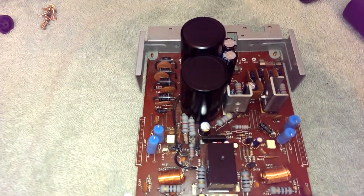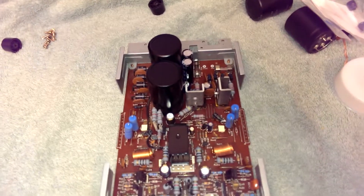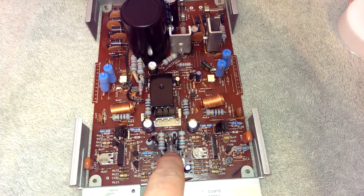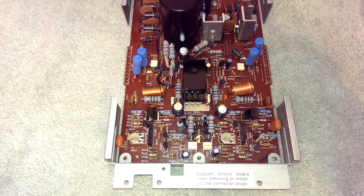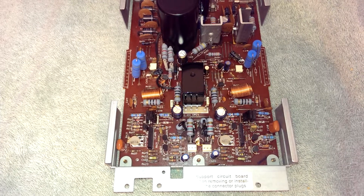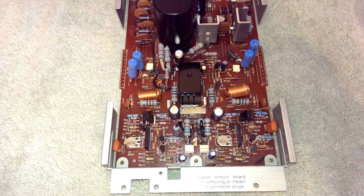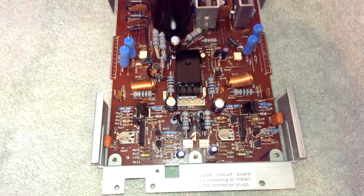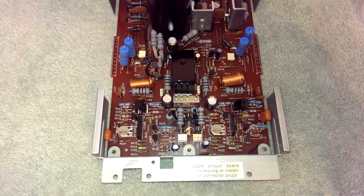I did have a little snag procuring capacitors. The ones I got had the wrong lead spacing and there's no way I can make them work, so I'm going to have to pay full price for those. I'm going to have to pay shipping to get that guy in because I don't have any — it's 125 degrees C — and I don't get much industrial equipment anymore. I am a stereo shop and a computer shop. I keep caps for stereos and computers, and none of that needs 125 degree capacitors.